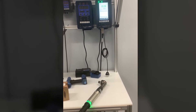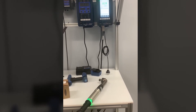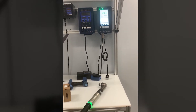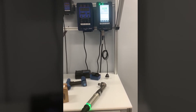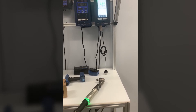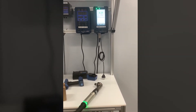There are two P-sets inside of a job in the Atlas system, and the P-sets automatically change to each other. But the acknowledge step requires the operative to go over to the controller, touch it, and acknowledge okay — that allows it to proceed to the next torque setting. This happens because the first P-set is a small torque and the second P-set is a big torque, but it's on the same socket.